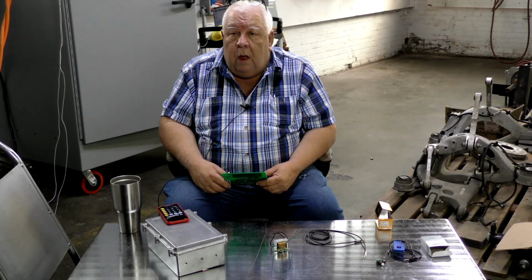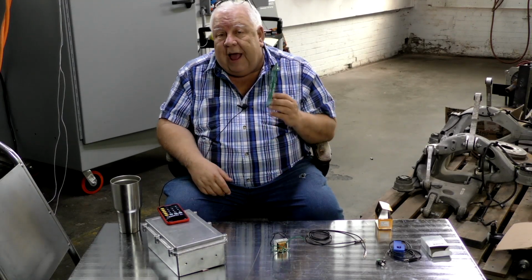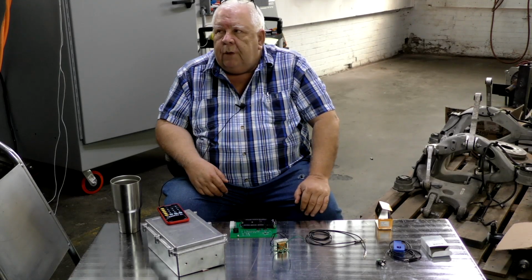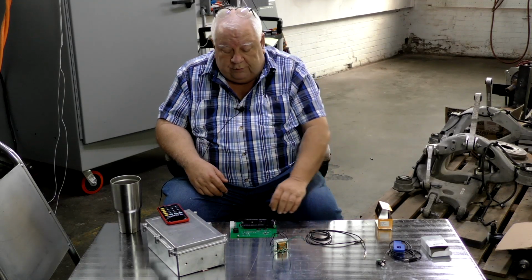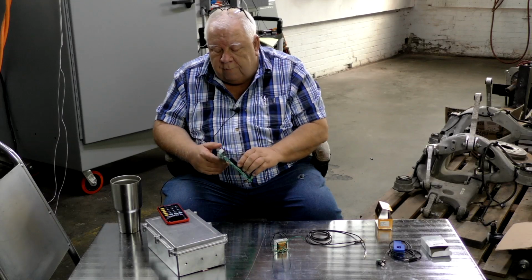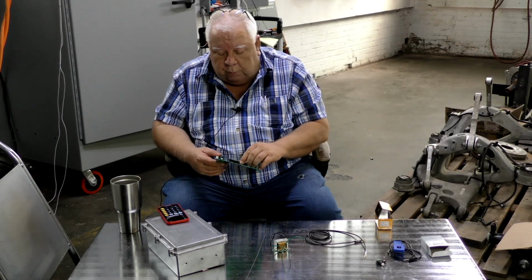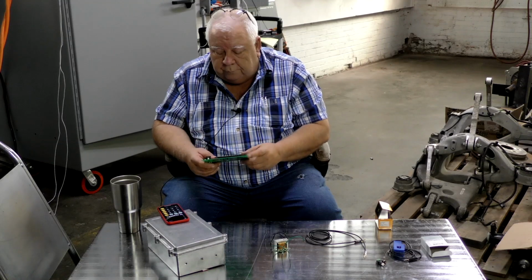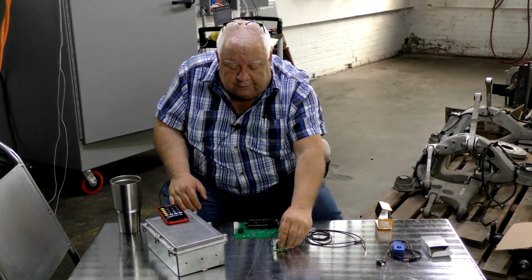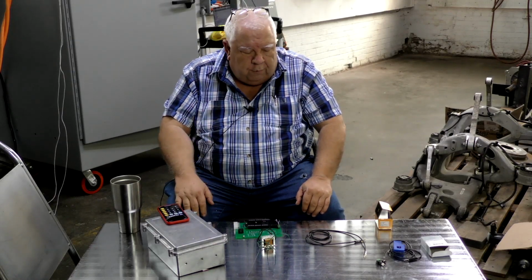On the board, I'm going to measure each of those separately, 7 volts, and use that to represent the 120 volts mathematically. But I also have a little rectifier on here, and I can take that 14 volt total, and that is within the range of my 12 volt regulator, which is on the multi-controller anyway. So if I can rectify that 14 volts AC down to a peak voltage that will be within the range of this device, our 12 volt regulator, I can power the board. So with 2 of these, I can sample the voltage of each phase, and I can power my board at the same time. No harm, no foul.